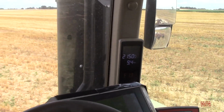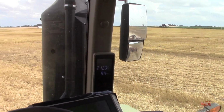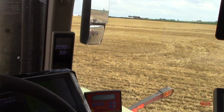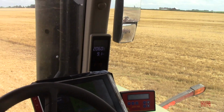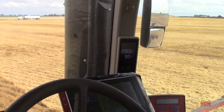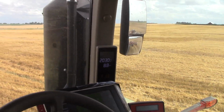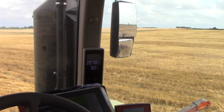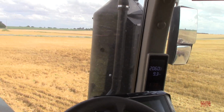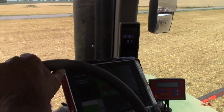Billy, what do you like about running the drill? We were talking about 30-inch rows, but it's more kind of a 20-inch space between the seeding itself because of the style of this Horsch drill. Yeah, the band that it seeds, it's not a narrow band, it's a 9-inch band. So kind of like a ribbon seeding effect out there. It is. I like it because of the speed I can travel. You wouldn't want to run this fast with a conventional planter. And we can run these kind of ground speeds with this unit. The ground's pretty rough. It's hard. Yeah, we're awful dry. You see the dust flying up behind the unit. It's pretty dry. Between sprayer ruts and the ground, it's definitely giving it a workout. That was a sprayer rut that we just went across.